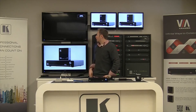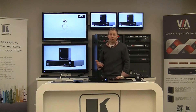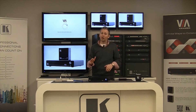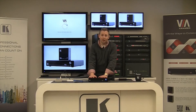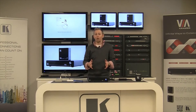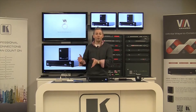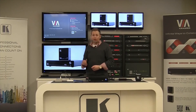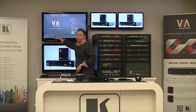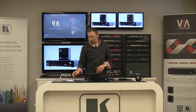Now you're going to see the Via Collage boot up. Once it boots up, you're going to see the wallpaper and the home screen. From the wallpaper and the home screen, it's going to tell you the current IP address. Now all Via products, and Kramer products for that matter, come with a default IP address of 192.168.1.39. Chances are that's not going to be the IP address you're going to want to use on your network. So the next process we're going to go through is setting the IP address so that it matches whatever your network administrator provided you with. Once you see the wallpaper, you're going to notice down in the bottom left-hand corner the default IP address.